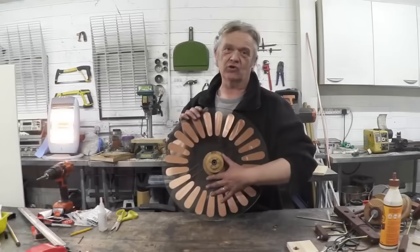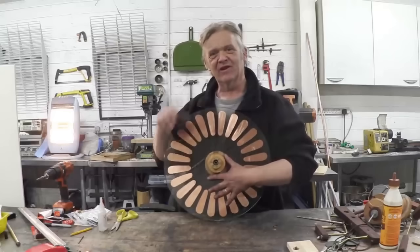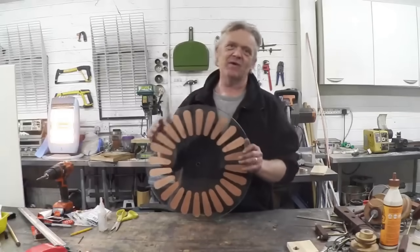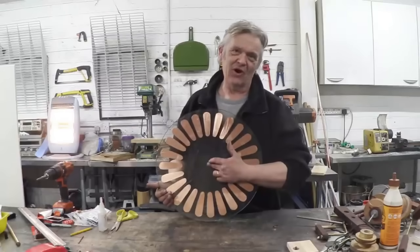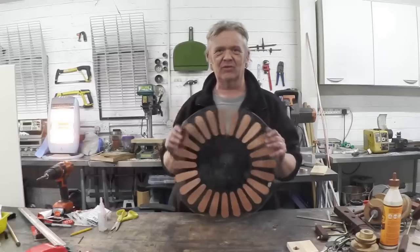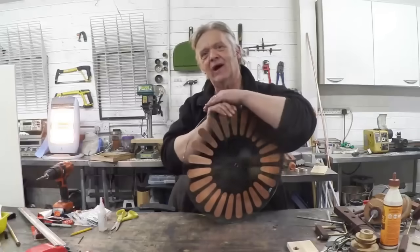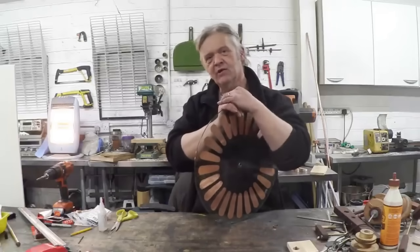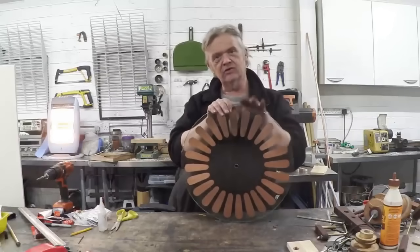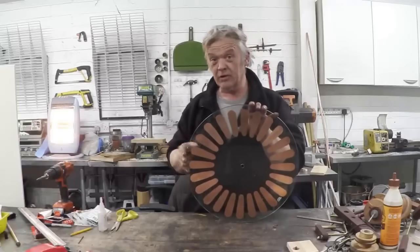Now we've got these discs, we need a cradle to hold the whole thing together. I've done the bosses so you can do a traditional one if you like, but I'm going to go a slightly different way because this is a great big bit of glass and I'm not sure if the centre is accurate. Instead, I want to go like they do a hubless wheel — rather than having a central drive, put some support around the rim so the thing can rest in a cradle and then drive it off the rim.